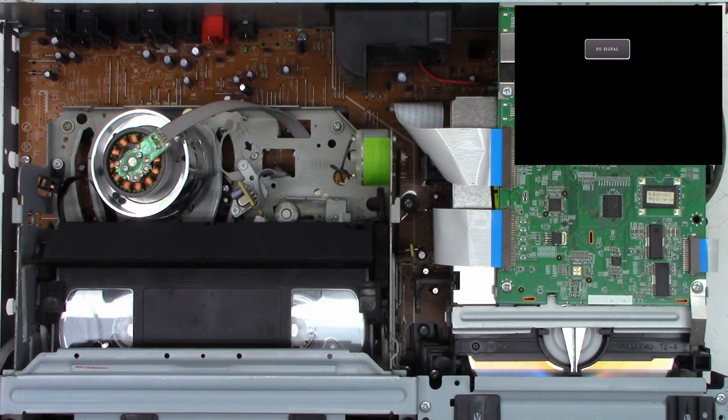Okay, so I've basically drawn a roadmap of the bottom view of all these capacitors with their values, so I know what to look for. So I've got the ESR meter out here. Let's go ahead and make sure that the leads get zeroed out. I'm touching the leads together, and I'll hit the zero button, and we'll go ahead and ESR all of these capacitors. So 220, that's the main AC input filter cap.